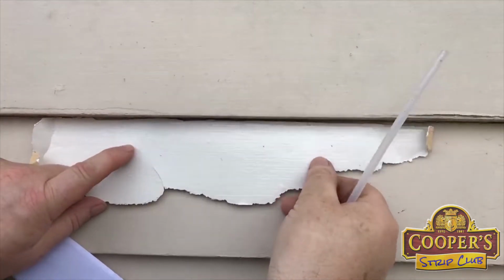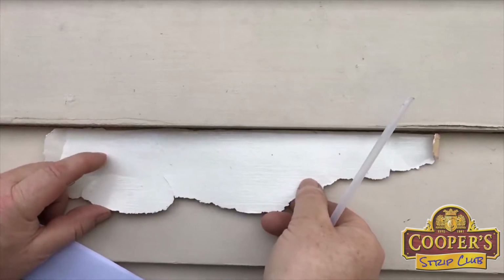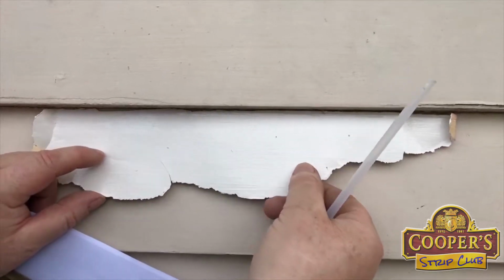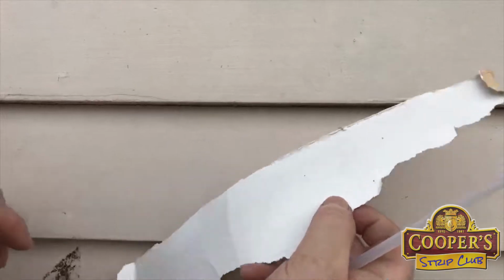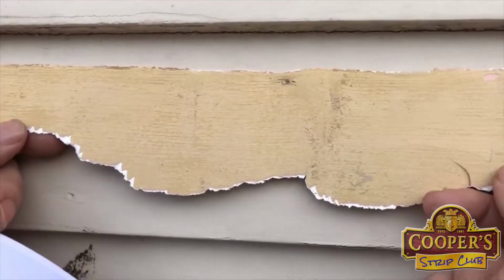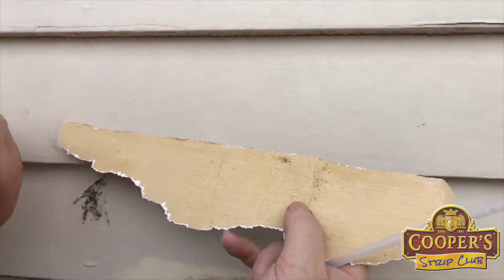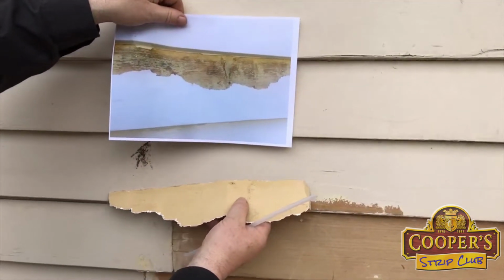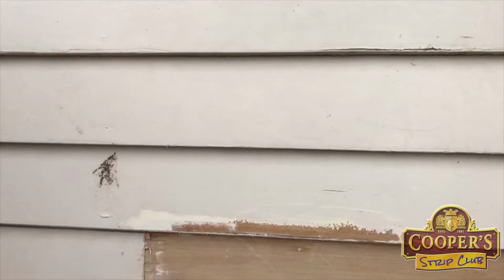It actually ballooned up. When I was there, I just trailed this off, and it literally dragged as the paint expands and contracts, which is what acrylic's supposed to do. As it contracted, it just snapped the paint and dragged it off. On the back of this, you can see that's lead, and it just took it straight off. Acrylic paint's pretty tough, and that's what it left on the surface. So she wasn't very happy, and so I advise people to keep away from the heat guns.